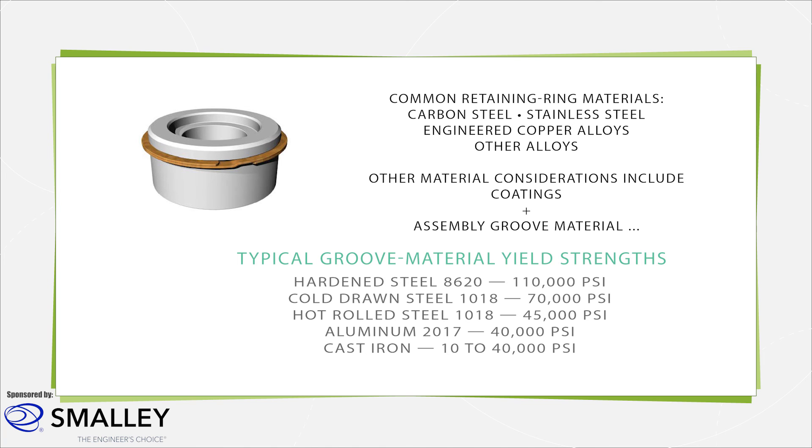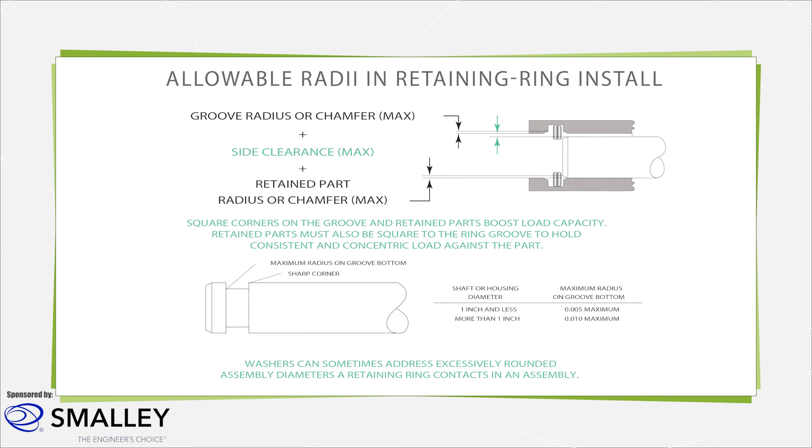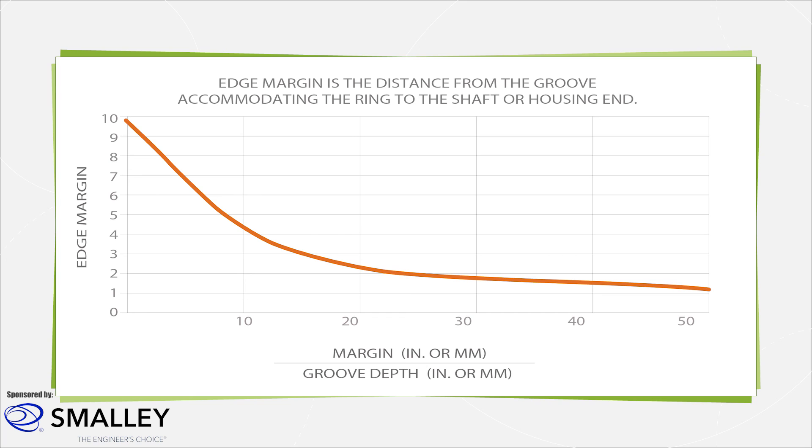Retaining rings can be customized to application requirements. Rings produced from coiling are easier to manufacture, often requiring only a simple setup with no tooling to produce a specific ring. If an application requires a specific end type or configuration, this is easier to produce from a coiled ring than from a stamped ring. Custom rings can be manufactured in sizes from four millimeters to three thousand millimeters in diameter, with inch equivalents. A custom stamped ring would require an additional setup and die.